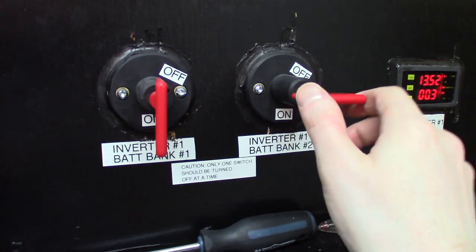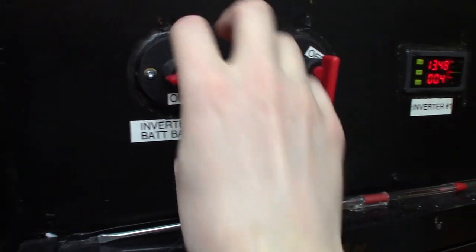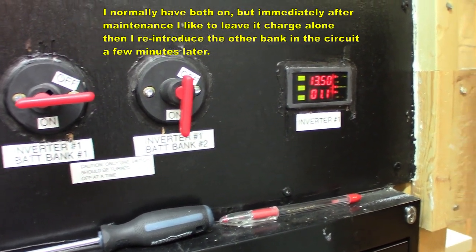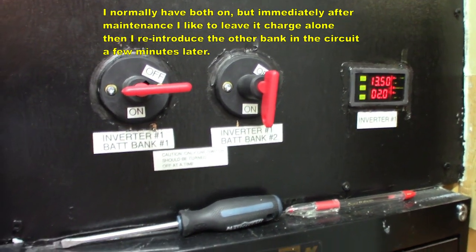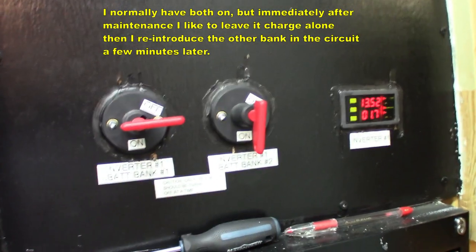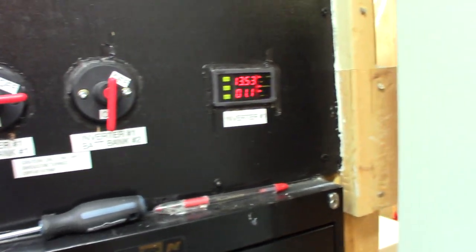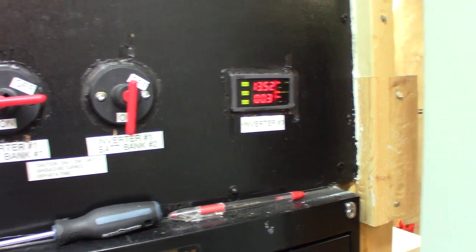It's very important to turn this bank on first and then turn the other one off. If they're both off at the same time and the power goes out, all my stuff shuts down. This is actually why there are two battery banks — so while these ones are disconnected, if power had gone out my servers would have been okay. It would have been a bit of a scramble, especially running on only one battery on bank one, but at least it gives me a chance to start shutting things down.